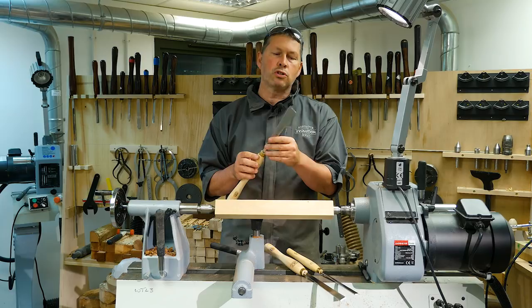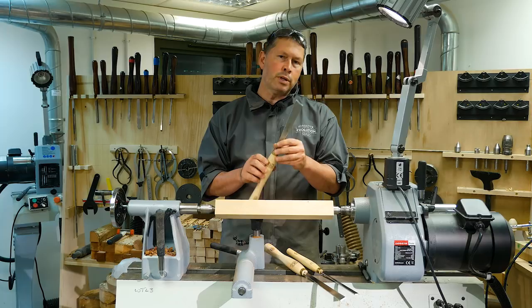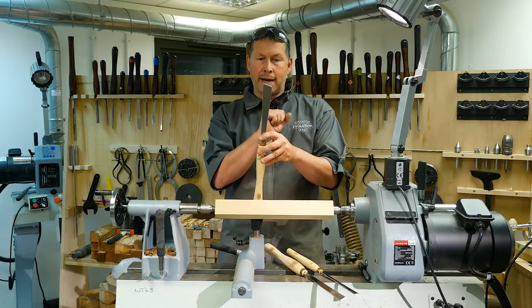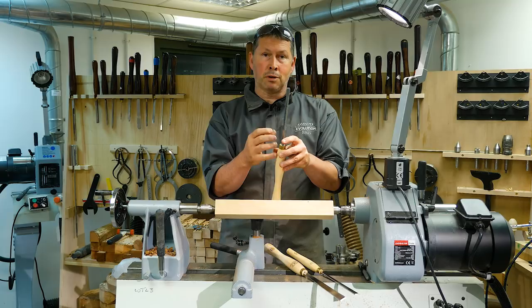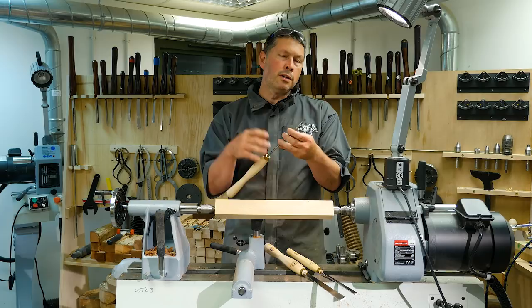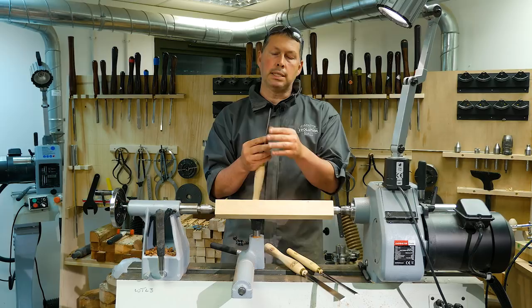So I've been working with Crown, and we've had a fair few designs to get to this stage. The main thing you'll notice about them is the splayed shape. Originally that's made by beating them with a hammer — they're hand forged tools — splaying the steel out but also making them narrow as you get to the end. Because of that design, they're much lighter than a standard Skew Chisel, which encourages a more delicate touch. Since most of my work is with beginners, this really helps make the tool less intimidating.